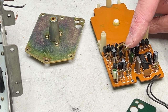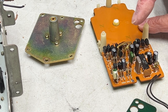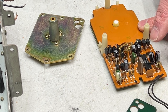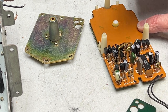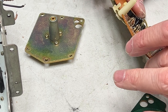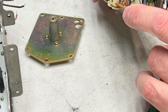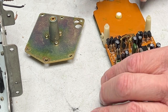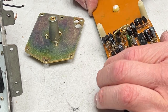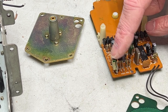There are a total of three 0.47 microfarad capacitors, two 10 microfarads, and one 1 microfarad. I used UKL on the 1 microfarad. The 0.47s are Nichicon VZ, I think. Something like that. And the two 10 microfarads are Panasonic FR. So these should be nice and happy. All 105 degree parts.